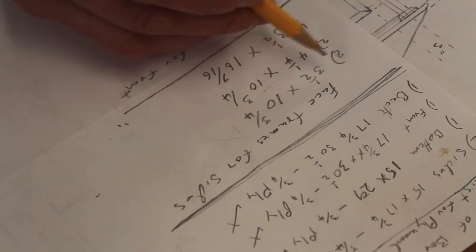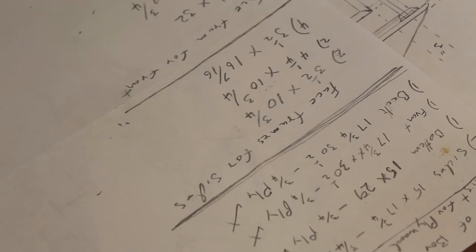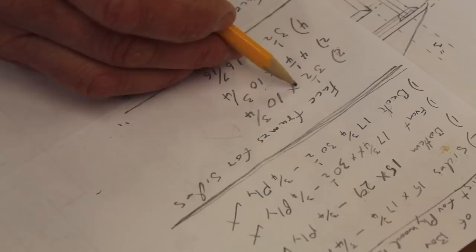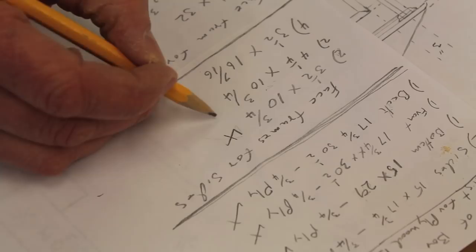Just to help you better understand a cut list: I've got a quantity on the front — that's my two — and this is my width, three and a half inches wide, and my length is ten and three quarters. What I like to do to stay organized while making the parts is, once I rip all of my material I'll put a check mark, and then when I've cross-cut all my material I'll put an X and then I know that I'm done. Basically the cut list goes like this: rip first, then cross-cut next.